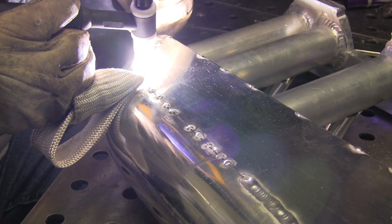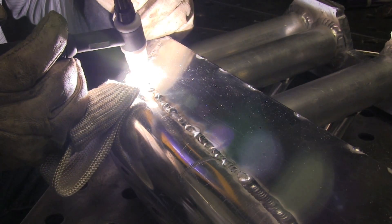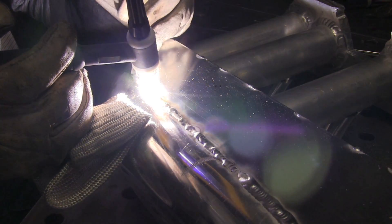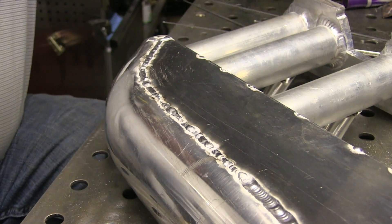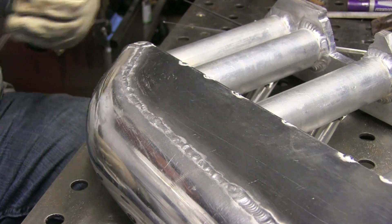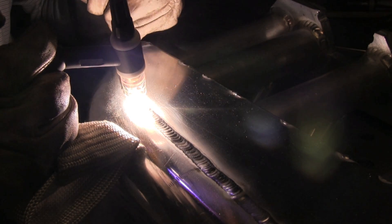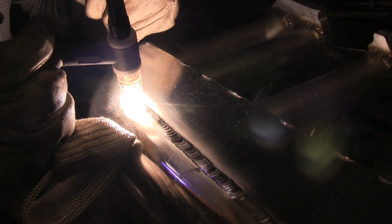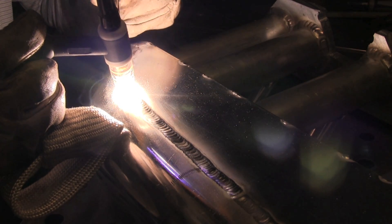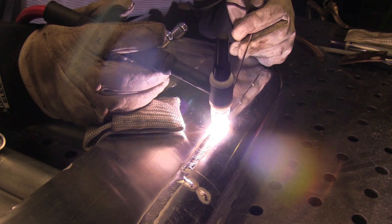Once you get used to it, it's a lot faster and you can almost just blast it and get rod in there. If you're not used to that, it's better to sneak up on it. Now what I'm doing here — I know this looks really ugly. I had a lot of tacks, but as I was welding, I could tell it was opening up, trying to keyhole on me, and I had to jam rod in to fill the holes, making it very uneven. So what I did is run a very small cold bead. It looks really ugly, but it's got everything joined together, so I can come back over it and not worry about holes opening up. It's making something that was going to look pretty bad look a whole lot better — minimal heat, just enough to put a little bead in, then let it cool, then come back over it with nice smooth penetration. This is a much better fit here, so I'm not having to do that and it's coming out okay.